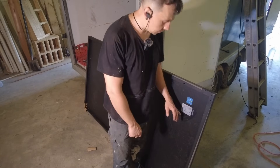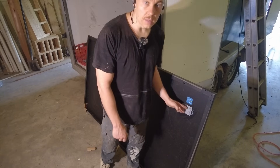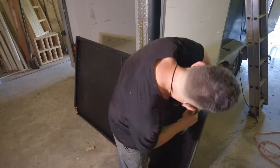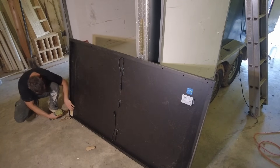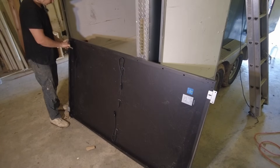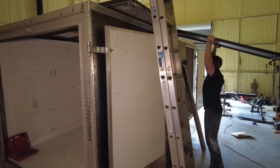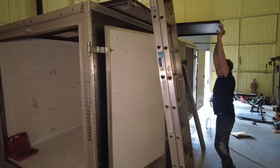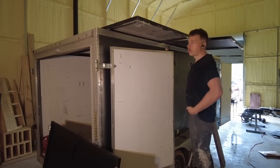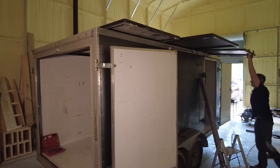For this project we're using the last six Alexis Solar 450-watt panels — these are 75 inches long and 44.5 inches wide. Six of these will give us a grand total theoretical maximum of 1,800 plus 900, equaling 2,700 watts. My charge controller handles up to 150 volts; these panels are about 34–35 volts each, so four in series is just under 150 volts.